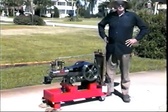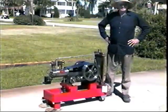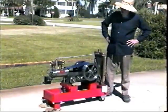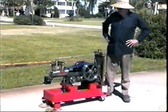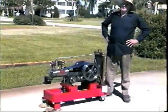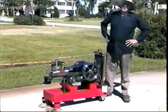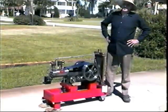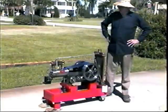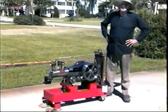I decided to convert it to all atmospheric. I took off the intake valve rocker, took off the push rod and the rocker to the fuel valve, and took off the push rod to the intake valve. I put a very lightweight spring on the fuel valve, just barely enough to hold it up, and put a lightweight spring on the intake valve, just enough to create some suction so they could draw the fuel valve open. The engine actually runs pretty darn well.